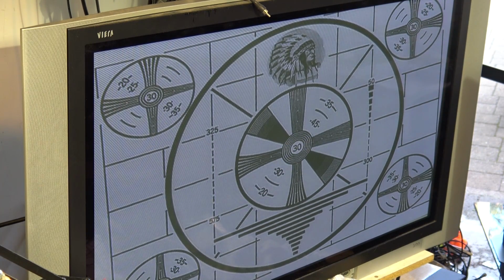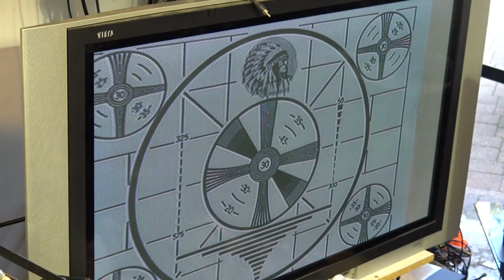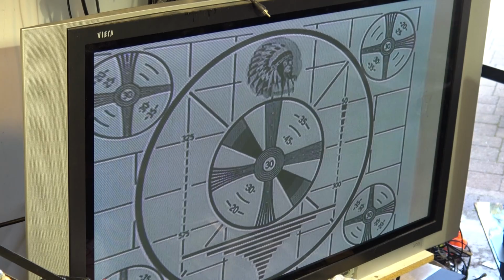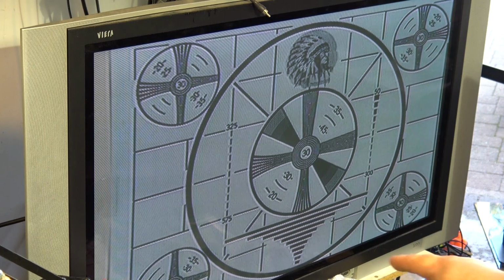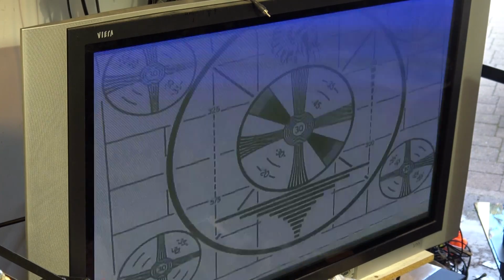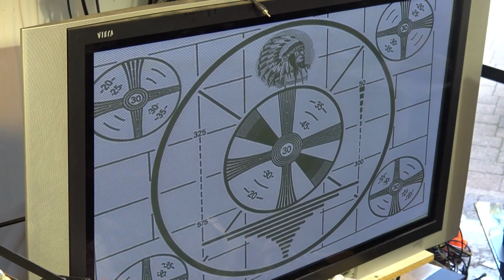So there's the Sony professional HD camera, and here's the Sony professional single tube camera. Quite the noticeable drop in detail. You'll see the Sony is falling off at between 250 and 300 lines of resolution, if we look down here at the bottom. And if I go back over to the other camera here, considerably better. I think I'm framed up pretty much the same size here.